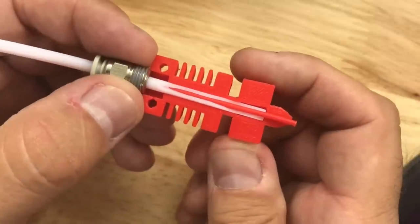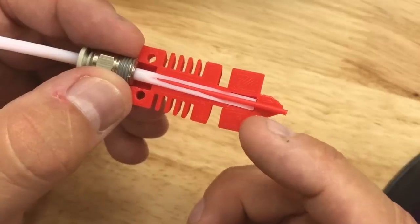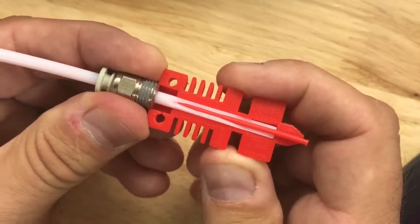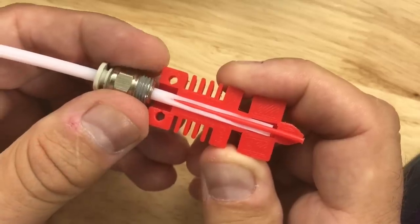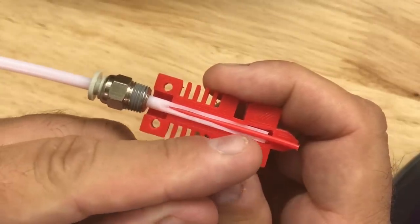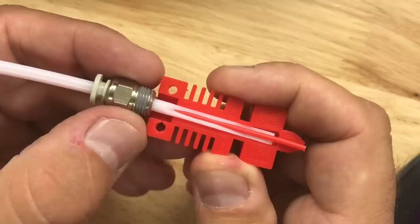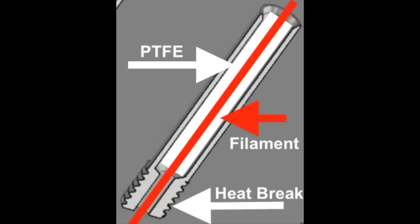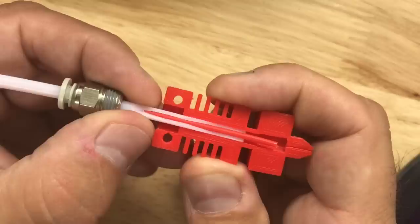Let me show you how I fixed it. This is a 3D print of the Creality hotend. The PTFE tube goes all the way down to the nozzle and the filament goes out the nozzle. The coupling up here keeps it tight against the nozzle. If it retracts and the coupling can't hold it, you form a gap, and then you get filament filling up that gap — that's where you get a blockage. The fix on Creality is to put a piece of PTFE tube trapped between the nozzle and the coupling with a washer to stop it moving. The Prusa Mini has something similar, but the coupling is up at the heat break with a guide that directs filament to the nozzle. The idea is to trap that PTFE tube between the coupling and the heat break, but any gap that forms causes a blockage quickly because that's a cold zone.